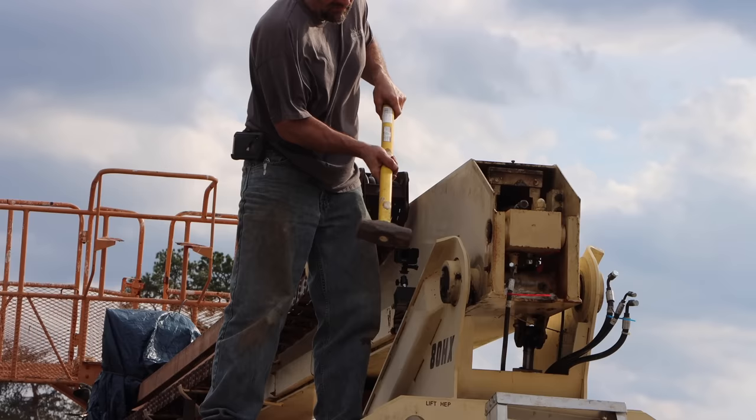Okay, so here's the plan. I am going to pick the boom up, get the dump truck out of there. The main lift cylinder can easily support everything while I'm doing this. The dump truck I'm going to use as a catch platform. First thing I'm going to do, go up there with the tractor. I'm going to pull that basically about halfway out so that I can then move the dump truck and get it underneath ready to catch.